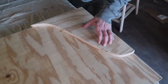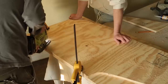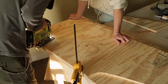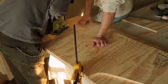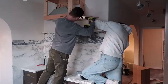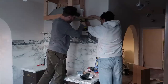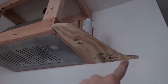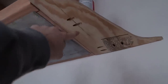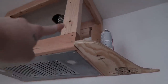Once the template was created, I transferred it over to some plain plywood with a pencil and I'm using a jigsaw to cut it out. I suggest cutting two pieces at once so both sides are exactly the same. We need two supports for each side, cutting those out and then securing them to the sides of the framework and the wall using pocket holes. I added the little side shape onto our box.